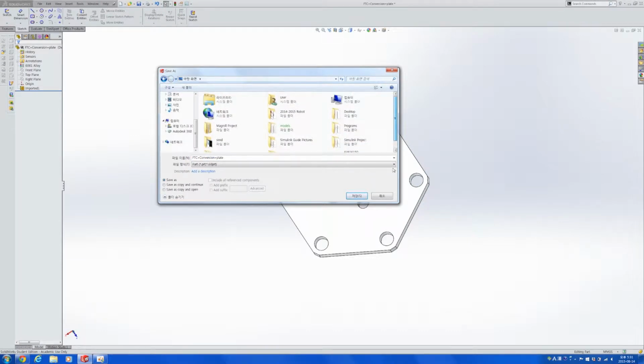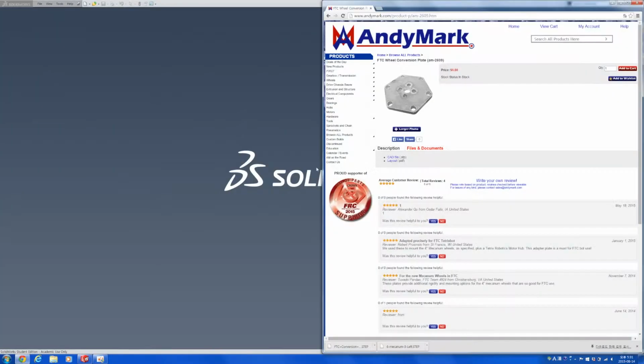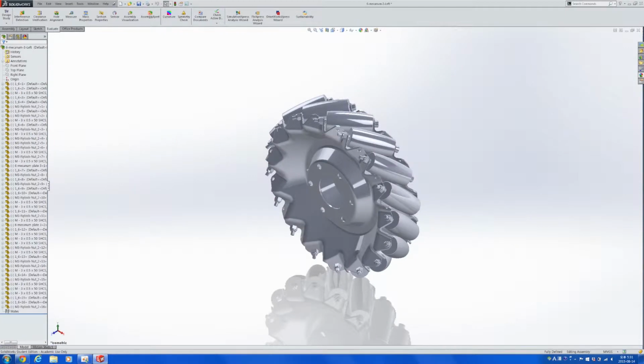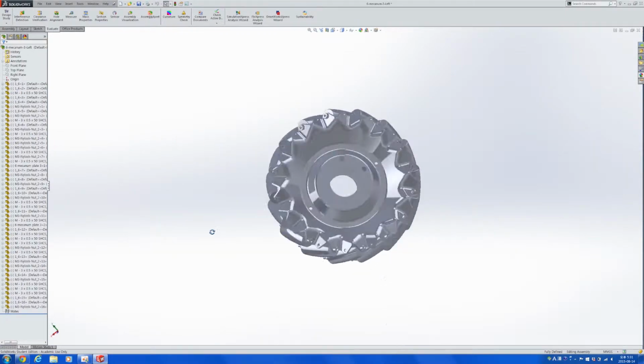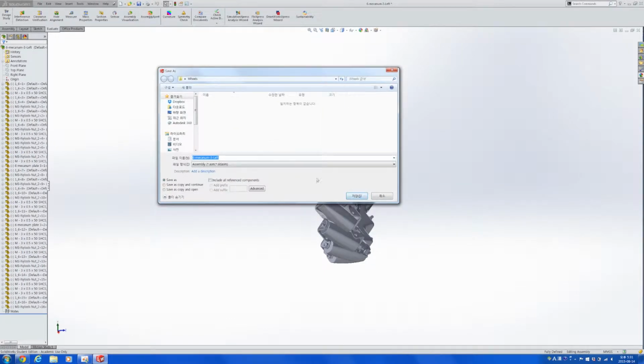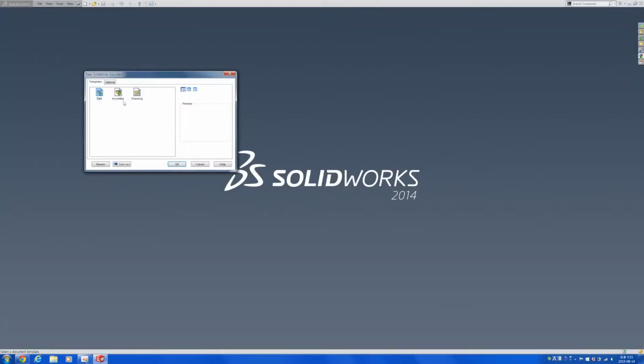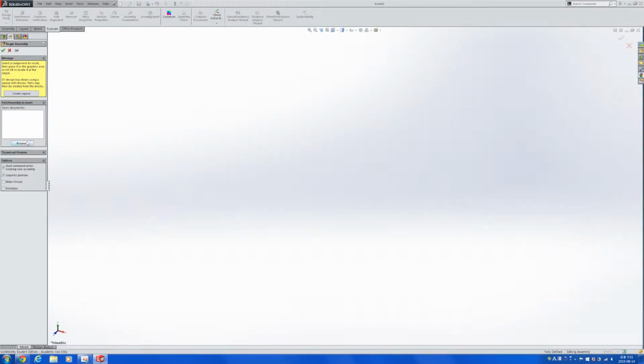And then after we save this, we can go on to import the mecanum wheels into this for review. The mecanum wheel is probably made out of a lot of different parts. The step file is probably an assembly file. It is very difficult for the computer computationally to make sense of all those different features, so we're not going to do feature recognition again at this point. But all the important parts, for example where the holes are, are already defined perfectly, so there is, honestly speaking, no real need for us to do feature recognition.